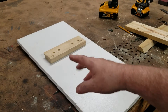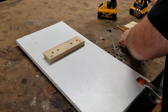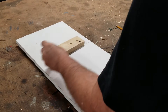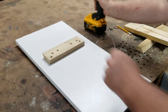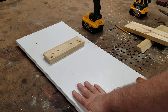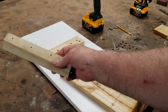Here's our setup — I've drilled some holes already to save some time. So imagine this is the wall; we're going to put the bottom portion of our sideways scarf joint and screw it to the wall. Now imagine this could be two inches long, an inch long, or eight feet long. It's an extremely strong joint and kind of self-seating because you've cut both pieces of wood — they have to fit together if you cut it cleanly.